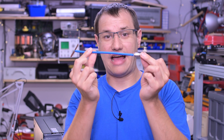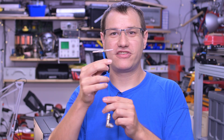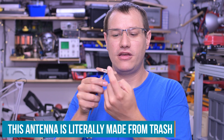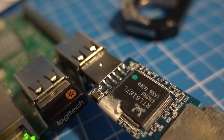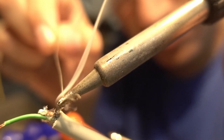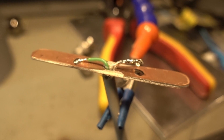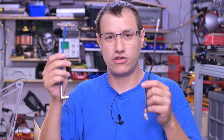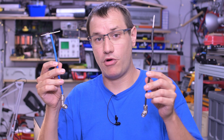The second antenna type is a dipole — a bit more complicated. I've got a BNC connector, some cable, and I've used copper-clad PCB to form the dipole. One strip is connected to the signal and the other to ground, and both have a specific length — in this case 30.5 millimeters each. Together they form a dipole antenna, which is a bit more directional than the monopole but has slightly better reception. These antennas are for experimental purposes only — be aware there are many regulations surrounding RF equipment. These are not tested or legal for general use; they are only for lab testing in an insulated area so none of the frequencies escape.